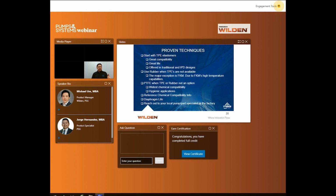Next would be to reference your chemical compatibility guide, whether that's in an OEM or an online format. These will give you elastomers that are compatible with your specific media. And like we mentioned earlier, if something's not listed there, just talk to your local pump specialist to help you select a really good option for your specific application.